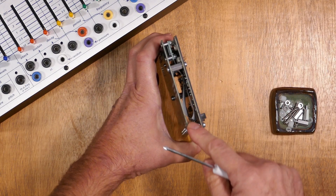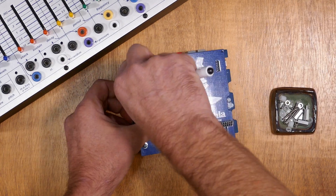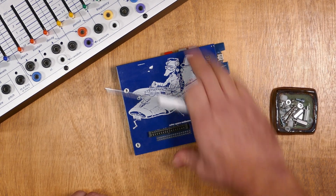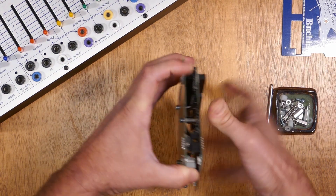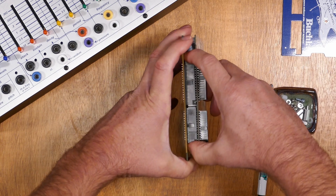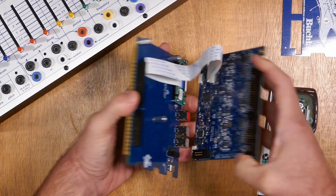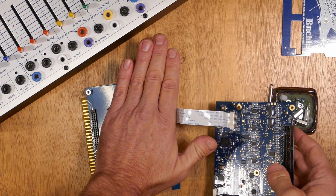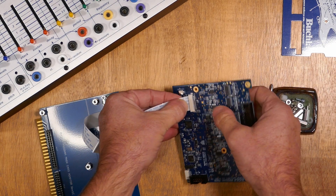The first step is to separate the two panels of the Program Manager card. You'll need to use the screwdriver to remove these three screws. Keep your dish handy so you don't lose the hardware — you'll be needing these screws later. Once the screws are gone, remove the faceplate, then separate the two boards. Start with the small header and get a little movement going to loosen it. Now move to the larger headers and start to loosen and pry those apart. You'll need to be careful as there is a ribbon cable connecting these two halves. Now that these are separated, remove the ribbon cable from the main board. Do not remove it from the screen, as small parts are more easily lost from that side. A firm grip and a slight tug will remove the display cable.